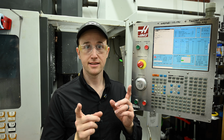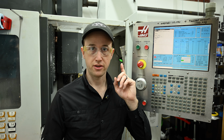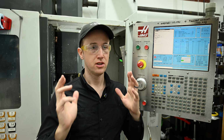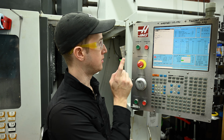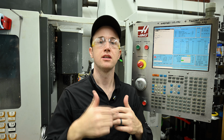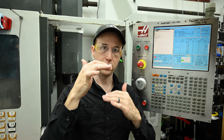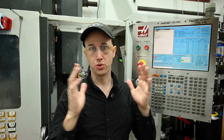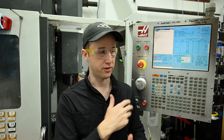A lot of folks have been asking about the Silver CNC tool setter that I have on my Haas. It's pretty economical, but the big question is how accurately it repeats. So I wrote a quick program on the Haas that uses a while loop that goes through 10 touches, writes each of the tool lengths into a 500 series macro variable, so we can see over the course of 10 touches, or whatever you want the while loop to be, how accurate it actually is over those touches.